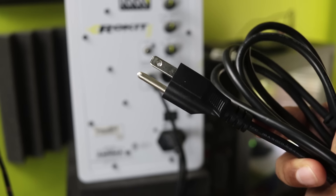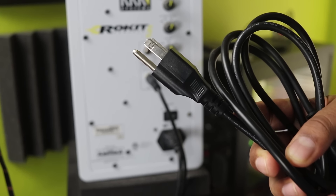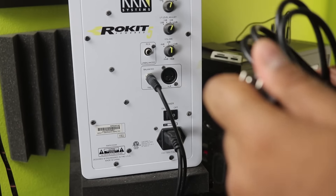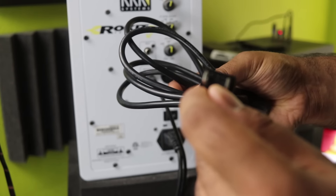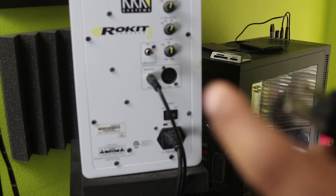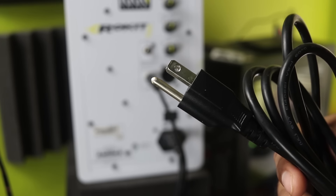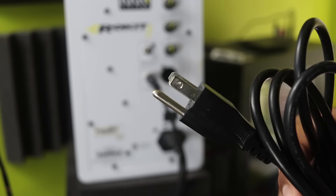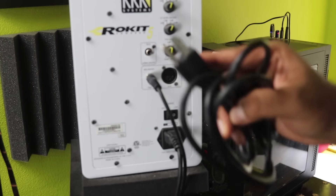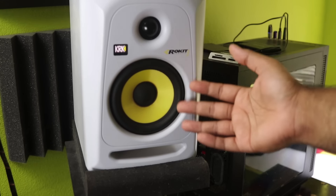I know that's a big jump from regular cables to that, but save that as a last resort. There are things you can get on Amazon cheaply — it's known as a grounding adapter. For those duplex outlets that only have two holes, you can plug the two-prong in and it adapts to three, which will help. Also, some power splitters may not be great for handling electrical noise — that could also be a situation. So make sure you're not only using balanced cables but also good adapters. That is how you can help fix that humming, annoying noise.